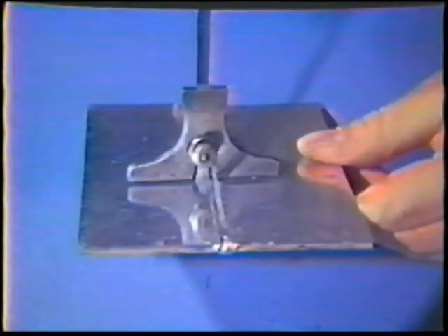The root reinforcement shall be a minimum of flush with the base metal to a maximum of one-sixteenth inch. The reinforcement for both face and root must blend smoothly into the plates, with transition areas free of edge weld undercut. Analyze the test results and check with your instructor.